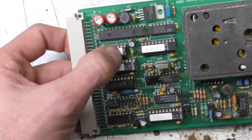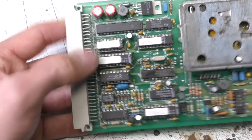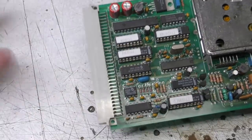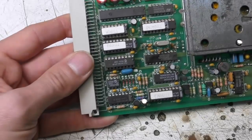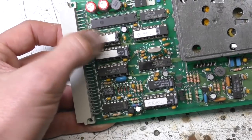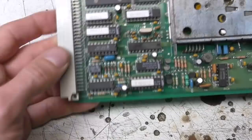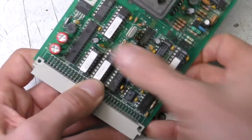There's actually a bipolar PROM on there. This was just to provide enough memory for the operating system to recognise that the device was there, so that the software could find out which slot it was plugged into and identify it. There was no software in there because you needed the external software to do anything useful with it, and there wasn't really space for any PROM on here. Two GALs and a PEEL.